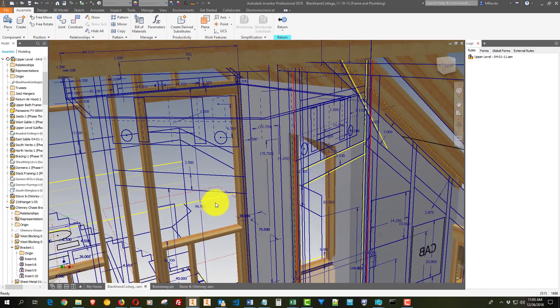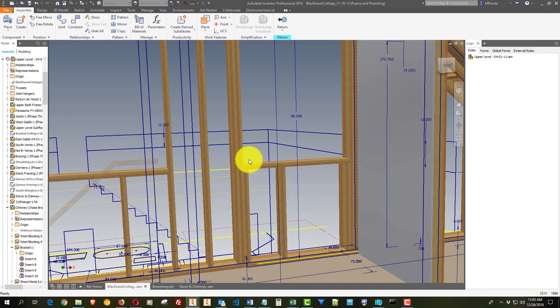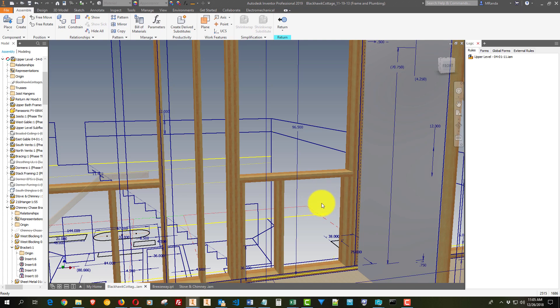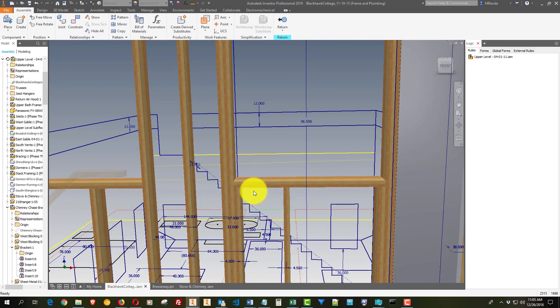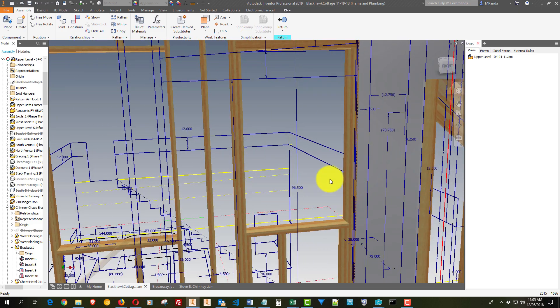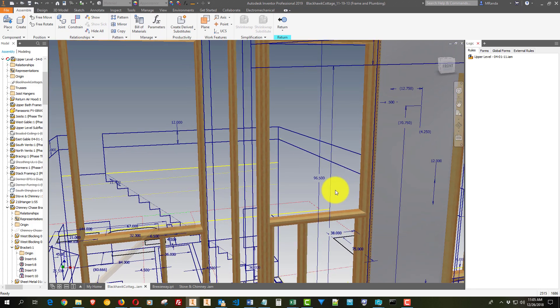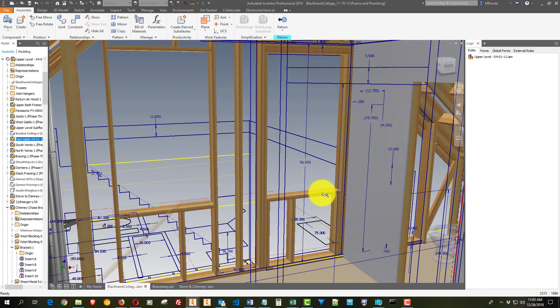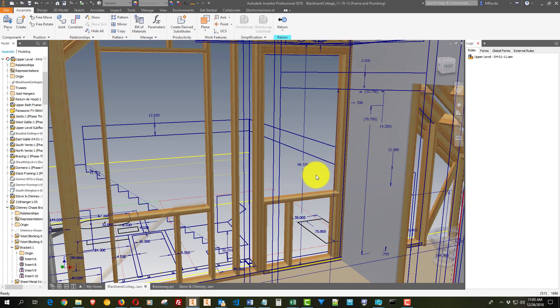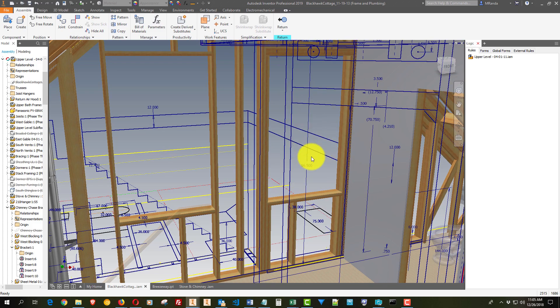All I've got to do is slice this drywall right here, pull the drywall off with the insulation, unscrew this lower part, and this becomes a door opening. I have to take the window out too — it should be just screwed in, hopefully. If it's nailed I'll have to pull the nails. Either way, the window comes out and will be used somewhere else on the property.